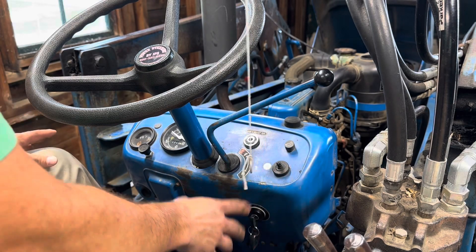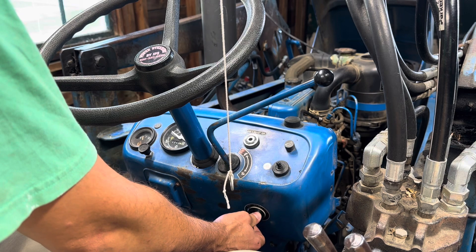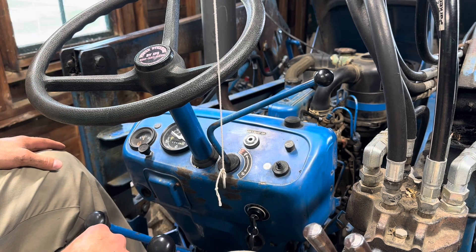Let's test things out — we're fully in neutral, throttle's off, no fuel tank in here. Turn the key on and still nothing. The battery might be dead. The battery is indeed dead — I don't know how that happened from a week of sitting here disconnected. I ultimately figured it out with testing with the multimeter. I hooked the lawnmower up to the tractor so I could put enough power in to just test the ignition switch, and indeed when it was hooked up with the lawnmower engine running, I had enough power to just click the starter with a partial crank over. So now I'm going to hook up the battery charger to see if I can just get it to start normally.